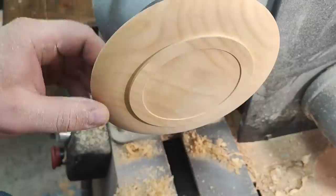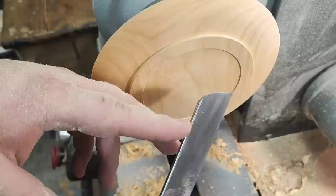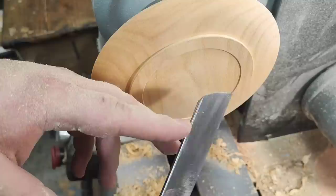The outside of the platter is done. Just a few minutes with sanding at 180, 240, and 320 and that will be it. I hope I've convinced somebody to start using standard scrapers a bit more. I don't have the need for a negative rake because I can get a really pristine surface off the scrapers — either flat, or even better tilted up on edge. I hope Tim this video answers your question.